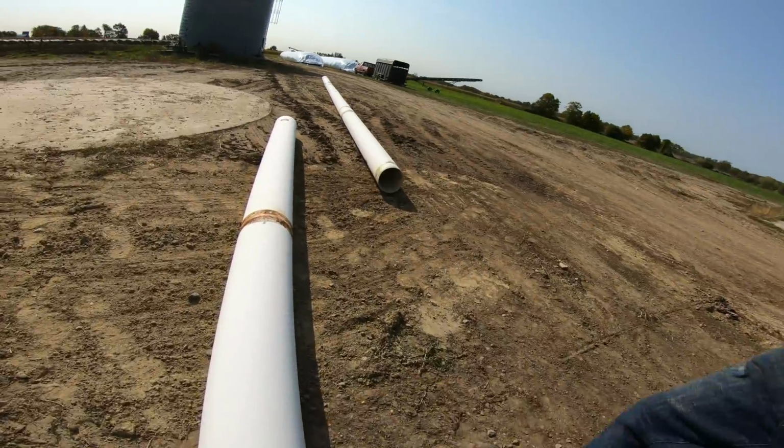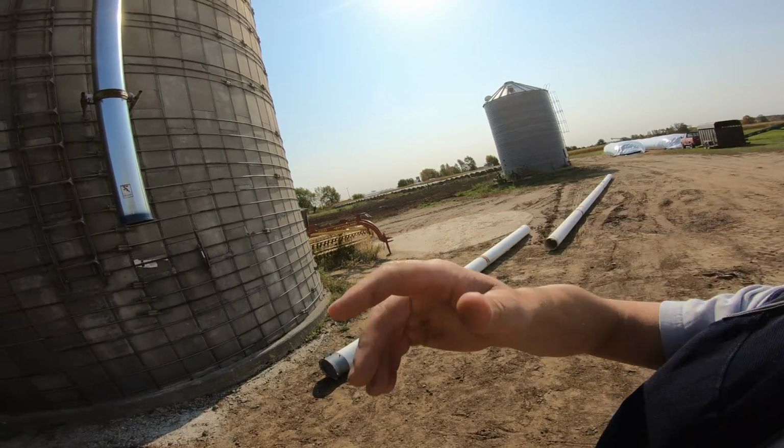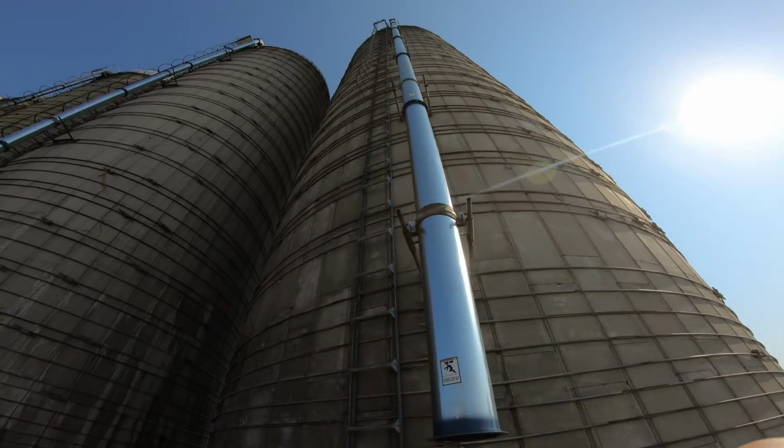To have energy, you've got to be well rested, feeling good. Here's the old pipe Daryl just changed. That was a plastic pipe. That was the first plastic pipe that we had ever put on here. It was cheaper, probably 10 years ago, and we'll never do it again. The sun will beat on them and make them brittle. Everybody probably knows that. It's common sense. This galvanized heavy duty one here, look at her, brand new. This thing will last a lifetime. So we got cheap on it, we won't do it again.